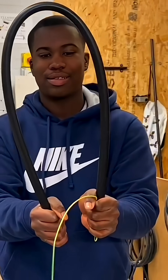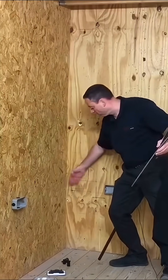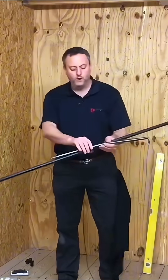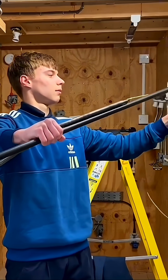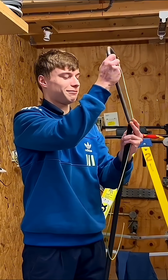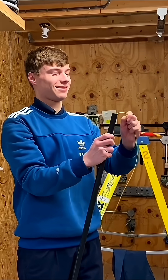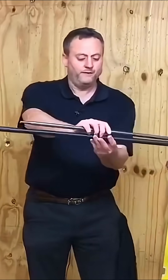I'm ready to put a 90-degree bend in my PVC conduit. This end is slightly shorter than this one, so we'll put the bend slightly more to one side. We're going to use a 20mm conduit bending spring — the idea is to prevent the conduit from collapsing when we bend it. You need a 16, 25, or 32mm spring depending on the size of conduit you're using.